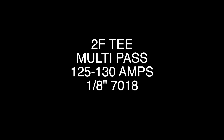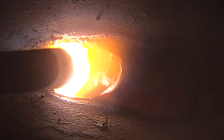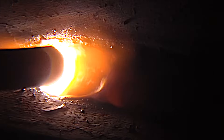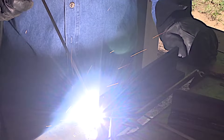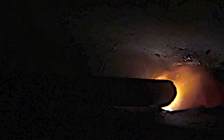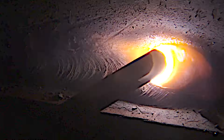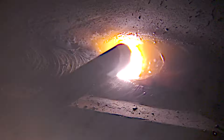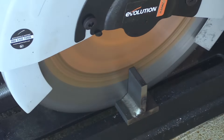Something you might do next after padding beads is a horizontal T, called a 2F position. Usually you'll do a multi-pass — not because the metal thickness requires it, but to get the most out of the metal. Put that first bead in, clean it well, chip the slag, wire brush it, then stack the next bead about two-thirds over the previous bead. Stack it two-thirds over, and that third bead will go in much better, giving you a decent, even fillet.